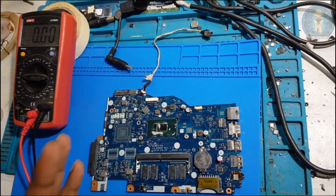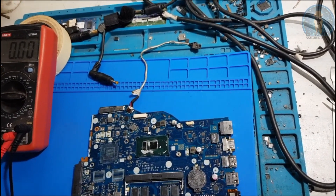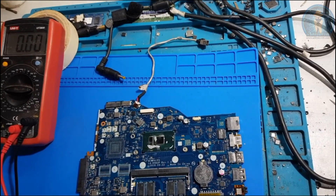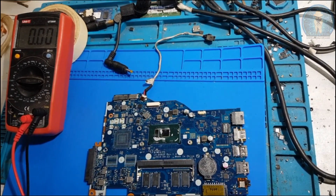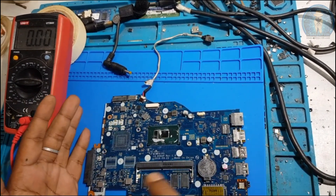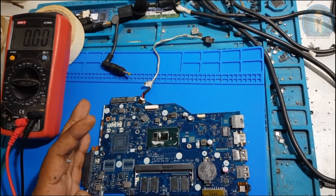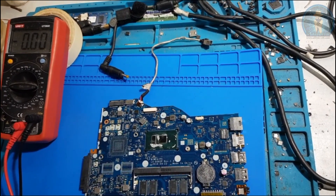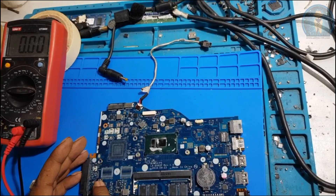On this new series board, I have already told you that 3V, 5V, 1.8V, and 1.0V supplies come before switch-on. It depends on the MBD architecture. On this board, 3V and 5V have already been checked as good.